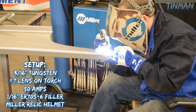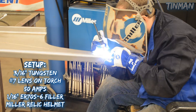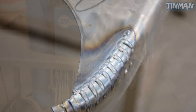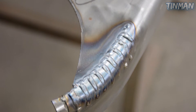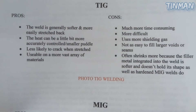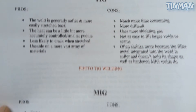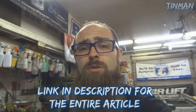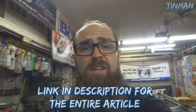The two basic welding processes we're going to talk about are MIG welding and TIG welding. Gas welding is very similar to TIG welding in nature in pros and cons, but we're just going to go through the basic simple pros and cons of MIG and TIG because they're the most commonly used — you can pause the video and look at some of these pros and cons. The general rule I always use is: if you have time, TIG it; if you don't have time, MIG it. Either process will work for basically any project you're working on, but sometimes TIG is required, sometimes MIG is just easier.